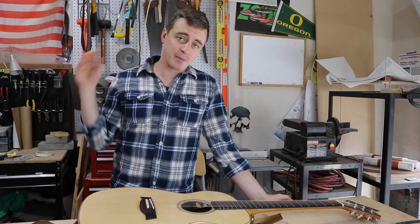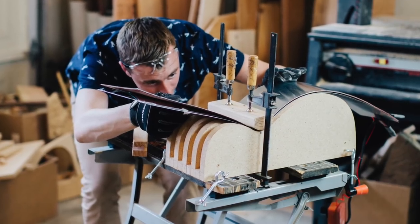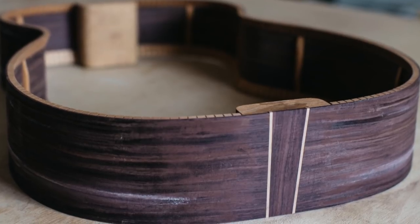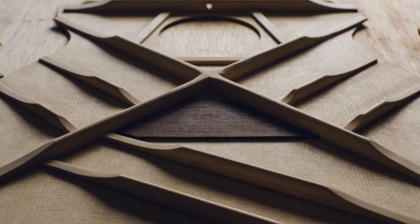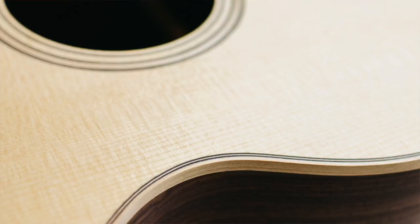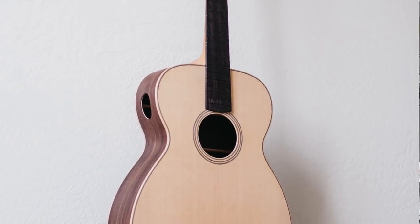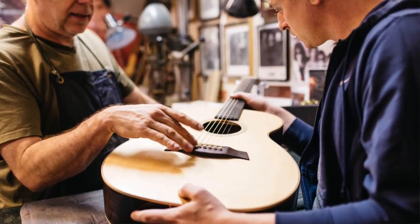Here's my best attempt at explaining the quick version of the whole guitar building process. First you bend the sides, then you attach them together, then you radius the sides and attach the kerfing, then you glue up the top and back and attach all the bracing, then you attach the top and back, then you install the binding, then you make the neck, attach it to the body, put a finish on it, do the final setup, and you're done.